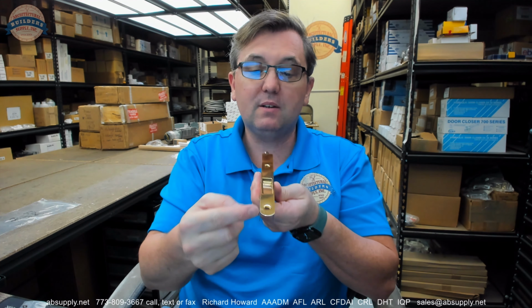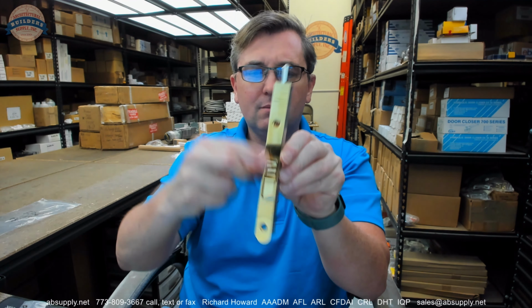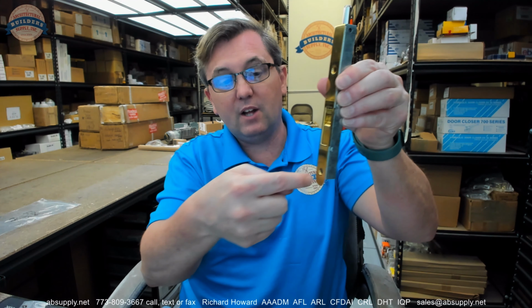You'd put your template on the edge of the door, depending on what you're doing or how you're doing it. Really simple and straightforward. Clearly, I would be using a 3/4 inch diameter 2-flute carbide bit. I don't want to have to use a 1/2 inch bit, do the 3/8 radius separately here, and then do something else. You can, if you say to yourself, well, I'm never going to use a 3/4 inch diameter 2-flute bit again. Sure, whatever it takes. You might have a 3/4 inch Forstner bit that you can do the edge of this, and then prep it with, whatever diameter router bit you have.